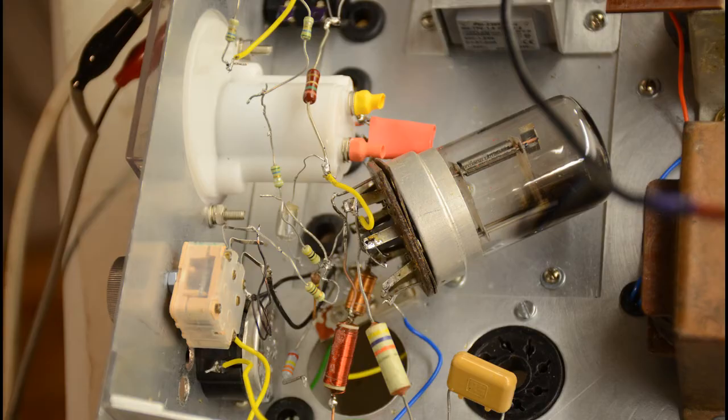Let's have a quick listen to the results obtainable on a few feet of aerial wire for the VR137, using a clone of the super-regen set with three valves. We're using it in the Radar Room Universal chassis with a 90-volt HT. Note that the signal strength here is very poor — we have an FM aerial on the roof to receive a decent reliable signal, so it's somewhat surprising that a single valve with a few feet of wire as an aerial works at all. The tuning capacitor in the chassis is in fact a 50 picofarad device — not something recommended, as tuning is extremely difficult as you can see.